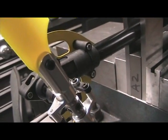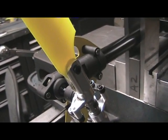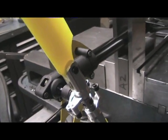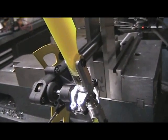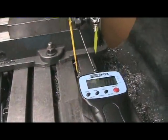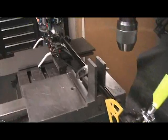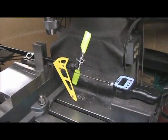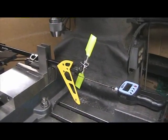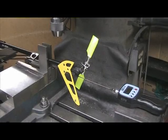This blade grip is basically a metal version of the plastic and has as much slop as the plastic version does. I do have a post showing the modification to make it adjustable for the amount of slop, like a Kasama. Here's the total setup with a force gauge for measuring the actual push rod forces, and the actual 500 is mounted on the milling machine just to hold it still while we run it up. We're going to fire it up and see what the push rod forces are with the stock Align metal blade grips and the stock blade bolts.